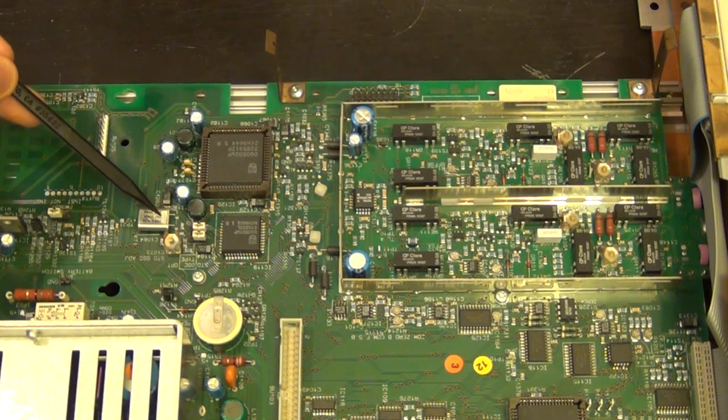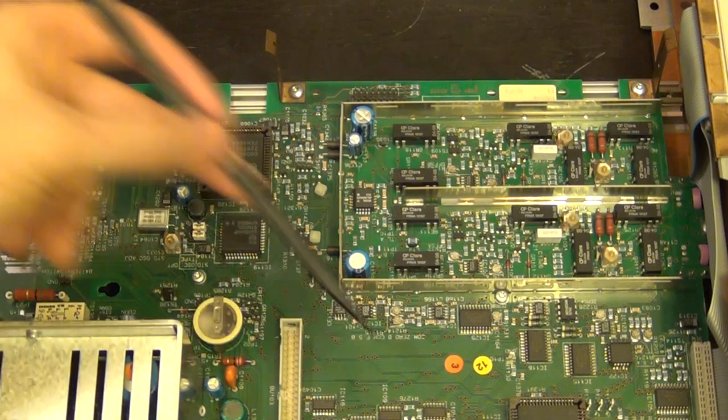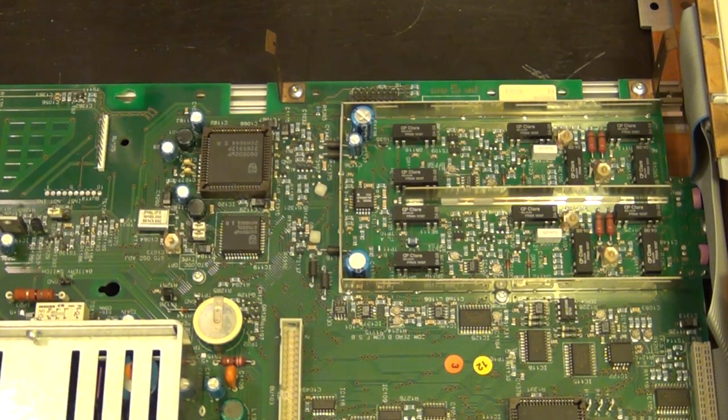And this is the only thing I'm going to play around with and try to calibrate and adjust later on. And it's got a couple of ASICs, which do nothing more than basically doing this pulse counting and comparing with how many counts you gain from the 10 megahertz reference. Now, obviously, this is a very simplified description of it, because there's a lot of things that go on in the background, but you're basically doing that. And other than that, it's really straightforward.